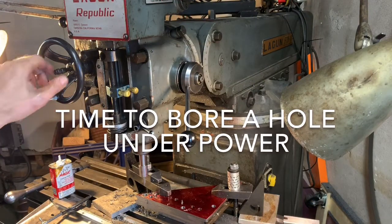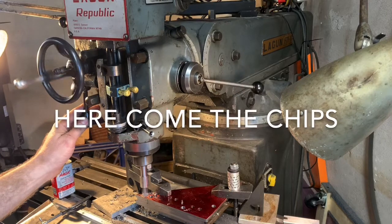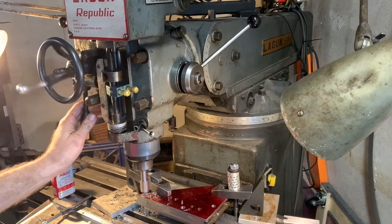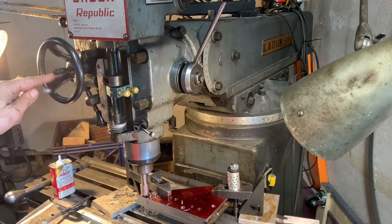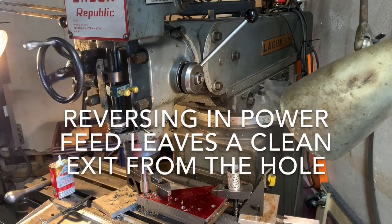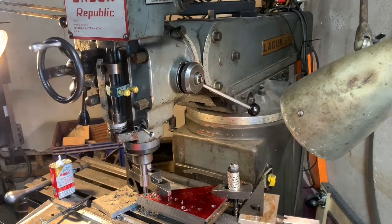Pull this lever and then get to the dial — okay, there we go. Looking good so far. Now I can reverse it: press in like that and back out of the hole. There's less tool pressure now so I might get a very small amount of material removal on the way up.